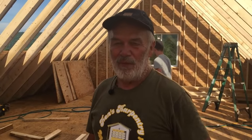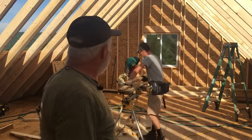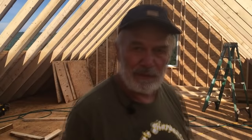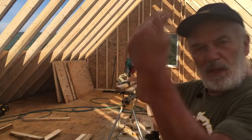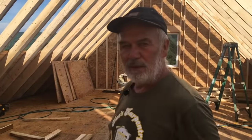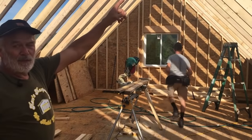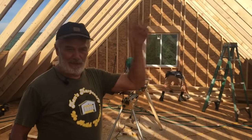What a beautiful day — it's going to be a lot hotter than yesterday, supposed to be in the mid 80s. Yesterday it was 70 but it was pouring rain so we were soaked. We've cleaned everything up and took all the bracing down on both sides. Chad's cutting the studs to build the knee wall all the way across. We don't want to go up anymore with plywood until we've secured that to firm it up — there's quite a bit of bounce to the rafters right now. So we'll do the knee walls and put collar ties across — that'll make like the letter A with extra support down at the bottom, so it's really strong.